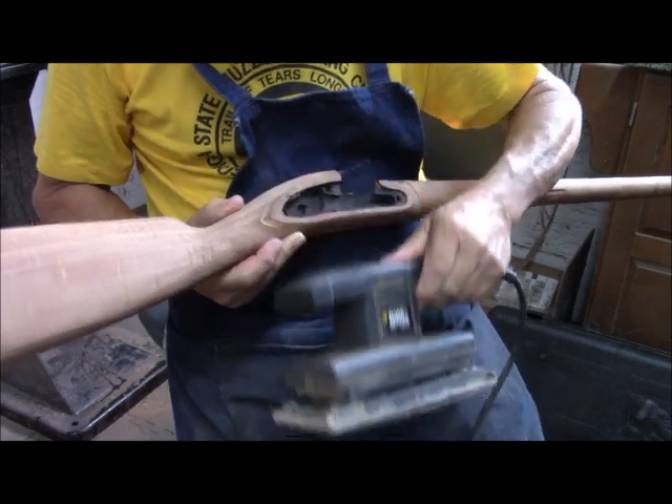I'm going to round this a little bit, but I'm going to leave this bulge and put a coat of wax on the wood here to protect it, because the danger is that any water coming down the barrel will instantly seep into the wood right here and go down the grain, unless it is sealed off with wax or something highly water resistant. We now have our stock stained with walnut stain — this is water-based — and after we steel wool this to remove the fuzz that's raised, then we'll start actually applying our coats of oil finish.